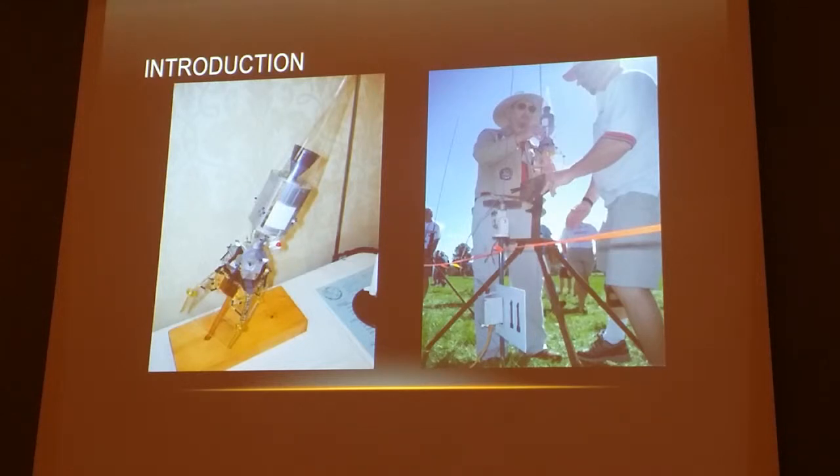That was kind of the start of going and doing those kind of parts. You can see where we're flying one of them there. It worked really well, but it's a deep-drawn plastic part. For anybody messing around with styrene, you can't get the parts to draw very deep. When I talk about a deep draw — if the diameter of the part is this long, you can basically get about the same depth but nothing more on a styrene part. What we found with PETG is you could get massive draws out of them. You sometimes get thin walls, but you could really make deep parts like nose cones and things like that for rockets. So it's an interesting technology that we decided to adapt to a couple of different models.